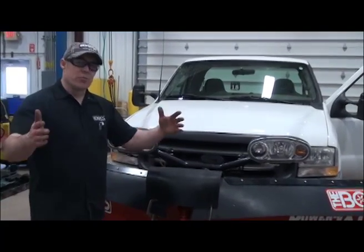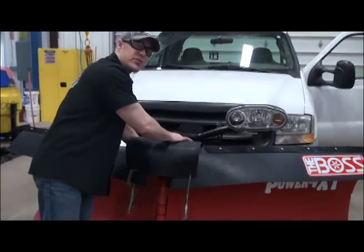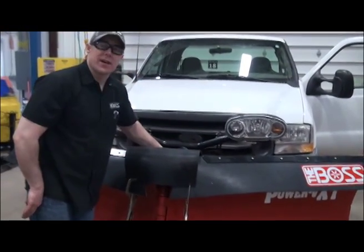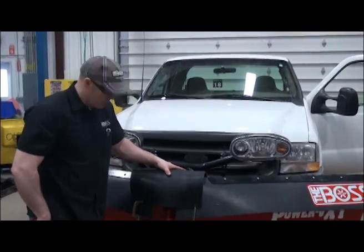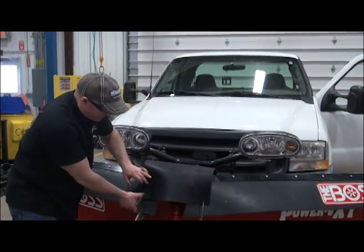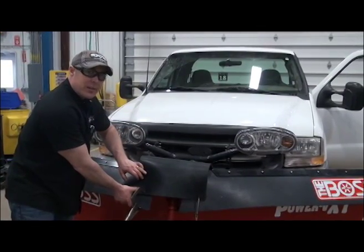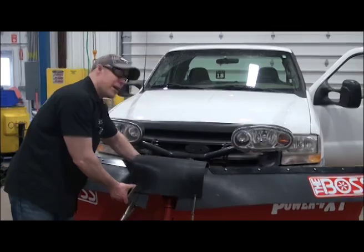All right, so we were in the scoop position, everything looked good there, we're back in the V position now. Everything still seems loose. I'm not overstraining that bolt. My deflector looks good right here. So what I'm going to do now is simply pull this back, transfer my 2 holes here, put my bolts in, and I'll be bolted onto my side belting. Last step is we'll talk about how to trim off the backside.